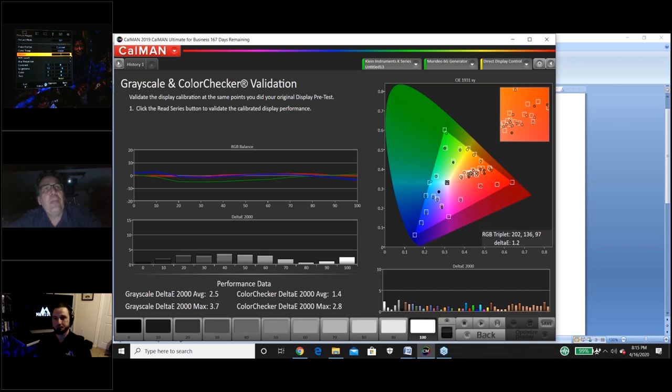If you go to the JVC website, they came up with some specific settings saying, in gamma D, turn up the picture tone, turn up the dark level, and it makes it more watchable, which does help, but it doesn't help enough without doing what's called custom gammas. So we're going to talk about projector calibration in general and custom gammas specifically for this projector.